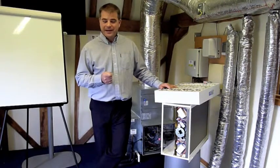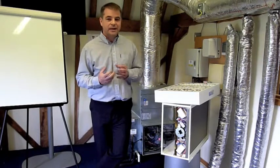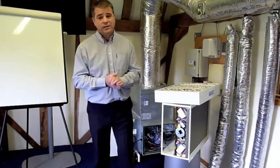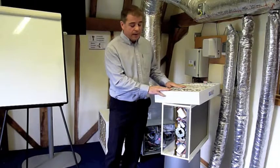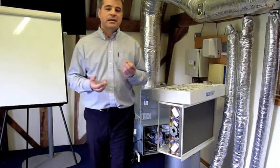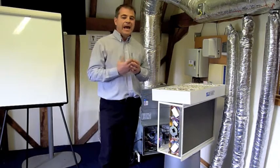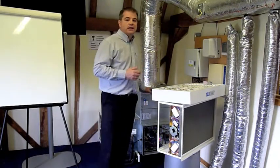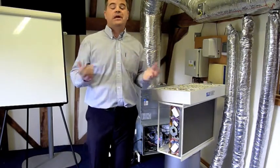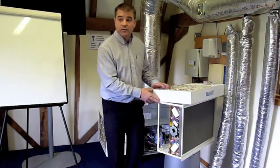Gyms is another big area which we want to mention. Gyms are a big problem for air conditioning units. When you see an air conditioning unit that's been operating in a gym, when you see it taken apart and serviced, it is full of some really awful stuff. So gyms are a great area, and obviously that leads us on to how this helps keep the heating and ventilation system and the air conditioning system itself clean. So all the gunk that's in the atmosphere would normally end up inside your air conditioning system, and it would coat the heat exchangers, put a jacket around them, which stops them being efficient. So keep them clean, keep them efficient, save you money, and in a large building that can really add up.